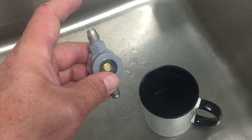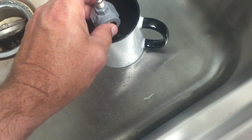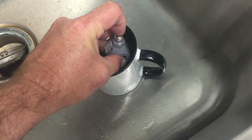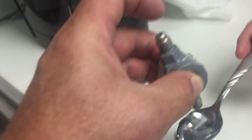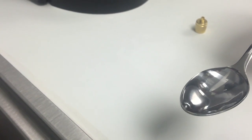This next section of the video shows what happens when we get moisture in the system and how that affects the evacuation. I'm dipping a sight glass in water, putting my finger over the end so it holds the water in. This is a teaspoon, and it's about almost a perfect teaspoon of water — that gives you an idea of the volume of water we're going to pull out with a vacuum pump.